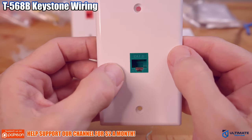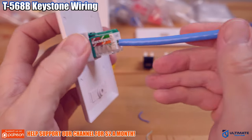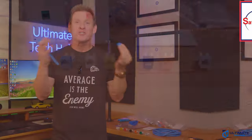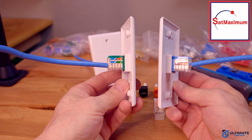That's how you install the T568B configuration. And these 45-degree angle keystone jacks make it super easy — I'll never go back to those old 90-degree jacks ever again. So guys and gals, this 45-degree angle keystone jack is amazing. It's durable, reliable, and super easy to install.